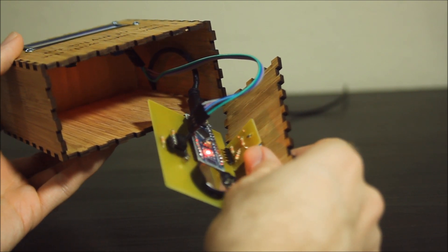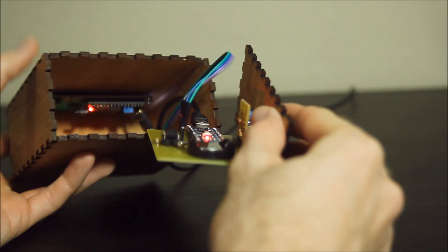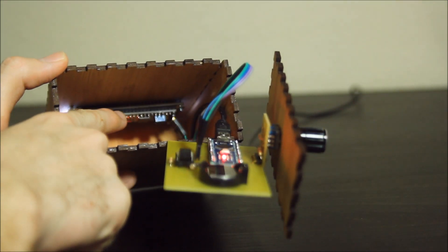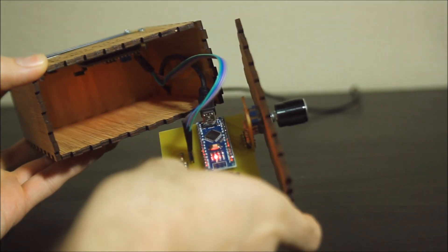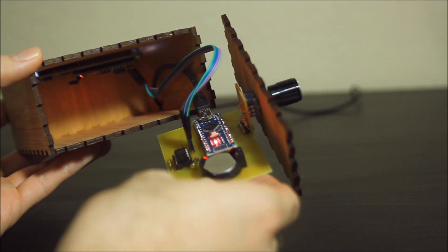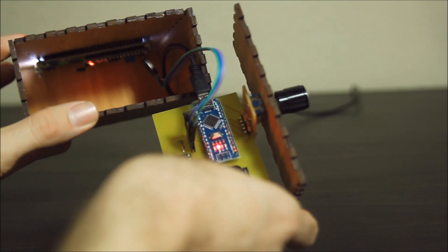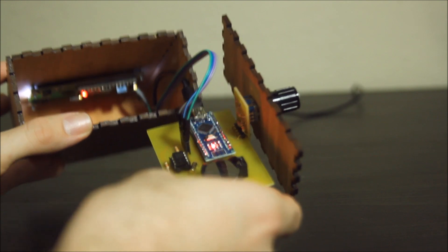And it really helped for prototyping. On the inside here, you see this is the back of the LCD screen. It has a serial backpack on it that I use to communicate with it, just to use a lot less wires and simplify things. The power is just gotten from a USB cord directly into the Arduino Nano — it just makes it a lot easier.